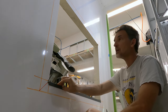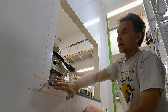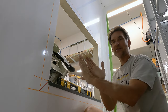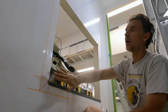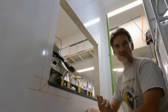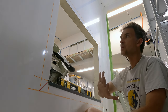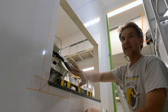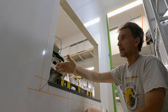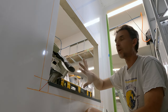It's a tenth of an inch. My angles that are going to start from the sides here and go down are actually going to cant out ever so slightly, a tenth of an inch, only a tenth of an inch, not a big deal at all. Easy enough for the adhesive sealants to take that and seal that up and create the strength for it, which there really isn't a lot of strength for that, but it'll fully seal that. But that gives me a little bit of a shedding on the outside of rain away from this, which is kind of what I want.